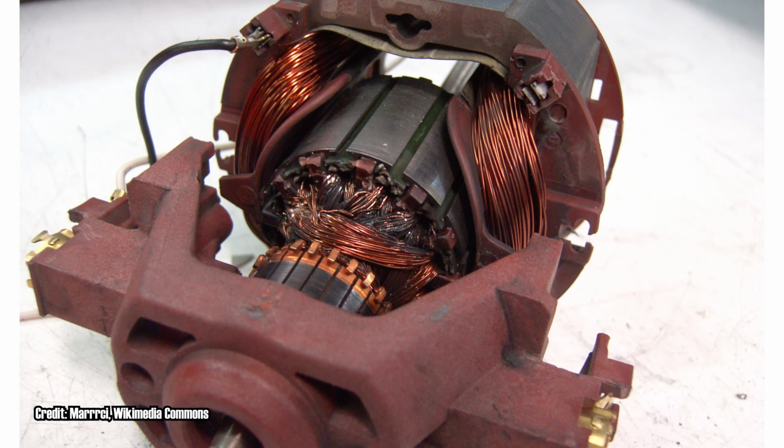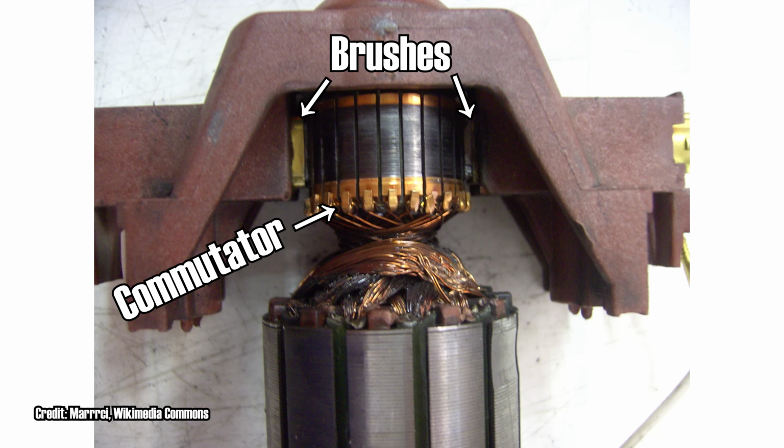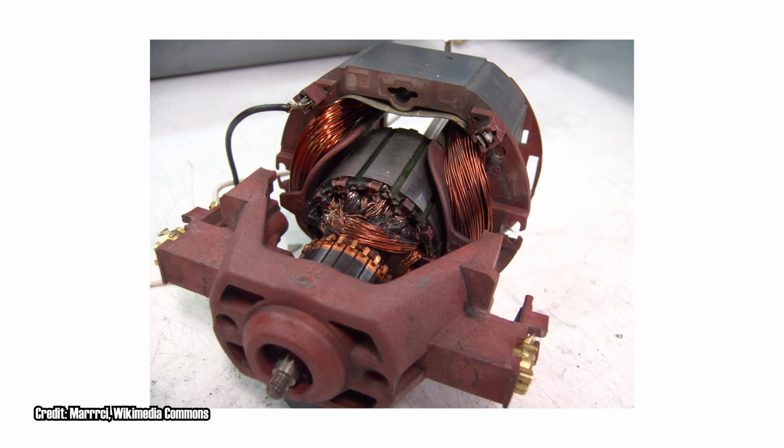So anyway, with only a single phase, you ain't getting rotation. You're just getting power and thus a magnetic field, which pulses on and off, and changes polarity with each cycle. Now, you can design a motor to work with that just fine. The universal motor is one such design. Here, a commutator and brushes are used to provide its own spinning field by switching the polarity of that field as the rotor, which typically is itself also an electromagnet, spins, therefore always creating a traction in one rotational direction. They even work on DC power, which is why they're called universal.